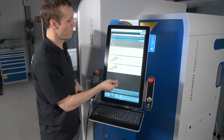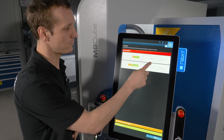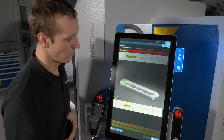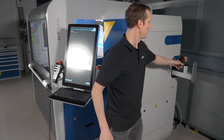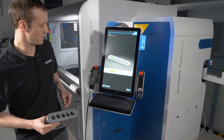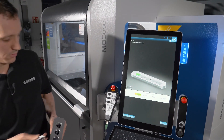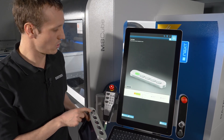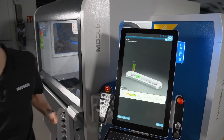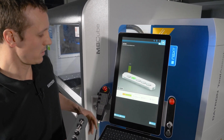In order to demonstrate this, I have prepared a little program where I'm using two tools which are currently not in my machine. I'm clicking on the first tool and say 'create in magazine.' Then I can take out this user supply, which is a little tray that gives me five different positions for tools. It's suggesting position number one for my first tool, so I'm putting my HSK collet into this position. For the additional tool, I'm doing the same thing with the second tool — a regular end mill. So I have two tools in my user supply.